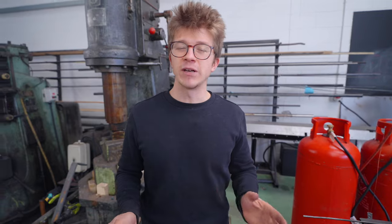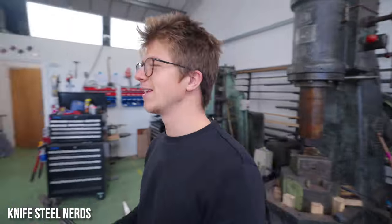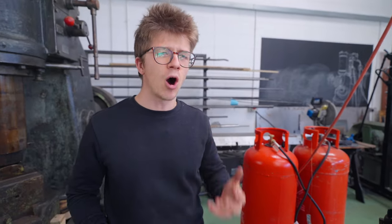How do I know this? Very smart gentleman who is an author, has a YouTube channel, and has a very handy website, Knife Steel Nerds, has a webpage with heat treating recommendations for AEBL stainless. 1,050 degrees Celsius should look pretty orange, I think. As you can tell, we're not going to be having the most accuracy in the world, but hopefully it gets hard enough to cut a rope when you need it.